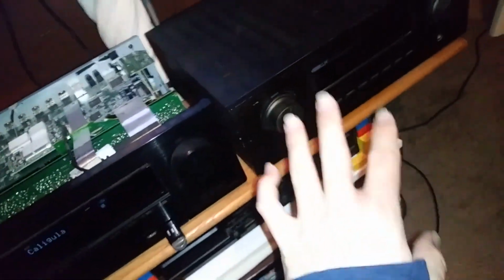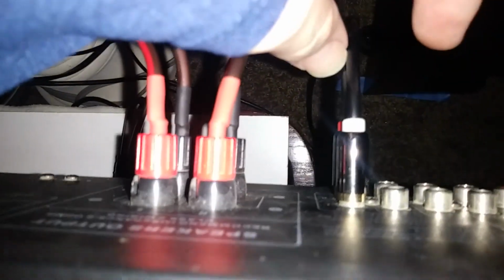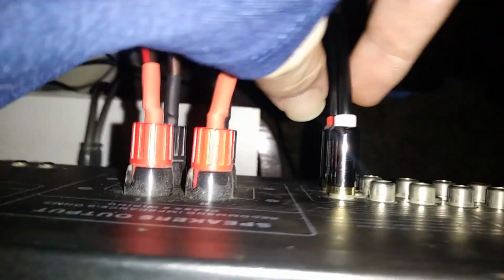Oh yeah. In case you didn't understand from the intro, the Yamaha next to Billy has been replaced with this. It's got jumper pins. The jumper pins come out of here, and that's the volume and the radio in this, and the various inputs, all its little brain, that gets outputted out the back, and through jumper pins goes into the amp. So I took the jumper pins out, and now the variable volume output from the DAP just goes straight in there. So that doesn't do anything.